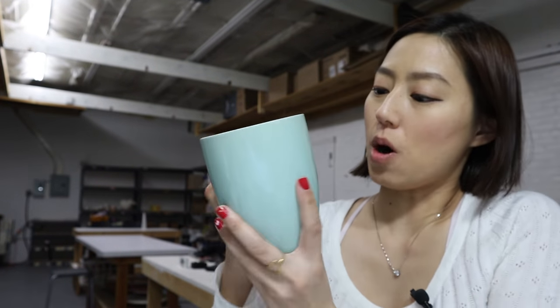Step two is to determine your seams for your multiple-part mold. To determine your seams, look at your model from all points and all directions and ask yourself: can I pull this out in one direction? Hot tip: whatever you want to cast, make sure it isn't anything precious because you'll be marking up your seams with a permanent marker and it'll be subjected to high temperatures. So don't go taking your family heirloom and putting it into plastic because it's not gonna come back.